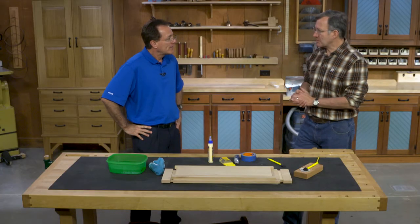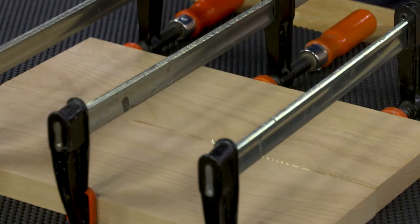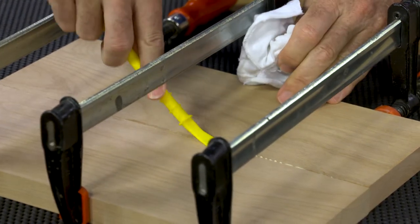If we do put a little too much glue in, there are a couple of ways to look at it. A damp rag will work, but sometimes you push the glue further into the wood, making sanding difficult before finishing. Some people let it dry, but glue can be really hard and chip out the wood. What we recommend is waiting about 20 minutes to let the glue kind of putty up — get soft without flowing — and then use the chisel end on the brush to scrape off the glue.